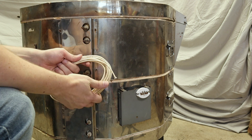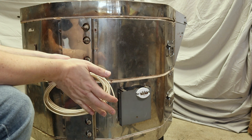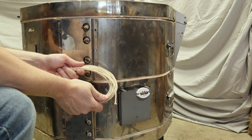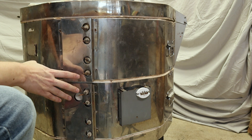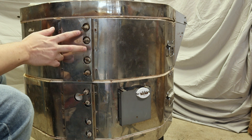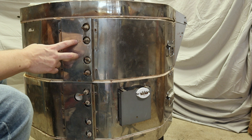To connect everything up I bought some high voltage wire. This will need to connect from the elements to the relays that I'm going to put somewhere in the kiln. I'm going to leave all of the leads relatively long and trim them later if needed. The Skutt kilns use one relay per ring and I'm going to do the same thing — one relay to turn both top elements on and off and one relay for both bottom elements. That means these will be wired in parallel.